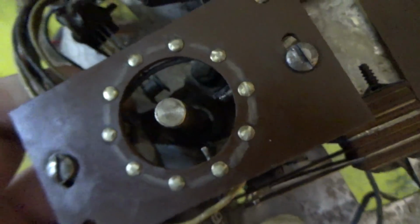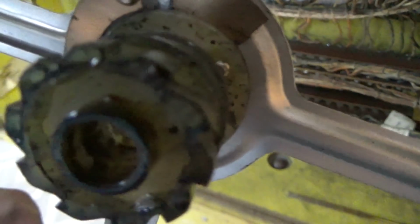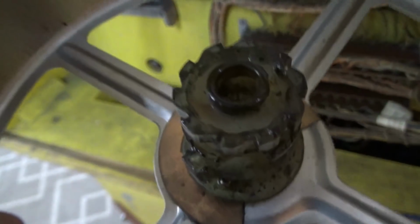Okay. Now it doesn't matter where you put this back in, because what actually shuts the switches are those two little inside cams there, not this top one. Somebody's oiled it a little bit, but we'll clean it up. So that's that switch. Like we said, that one will close at 9 probably.